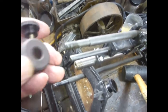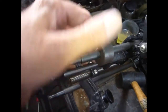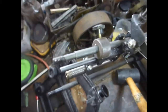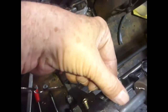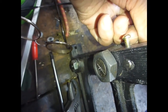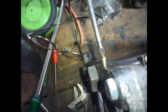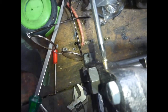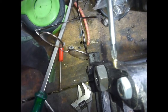Remember of course to replace the stop, which I forgot to do, so I had to take the side off again. It's important when you replace this bar that goes there that the end is flush with this end, otherwise at the far end it'll touch that spinning wheel. And then of course clamp it with the set screw. Then the job is complete.